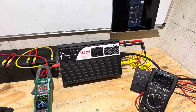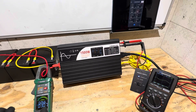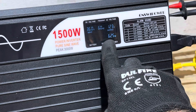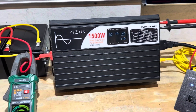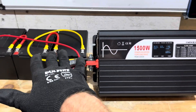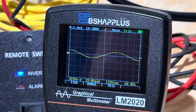The power cord is going out to a 12 volt charger. I'll turn the charger on and watch the current climb on the DC side. We're at about 3 amps DC as the charger initiates. On the AC side, the draw is 624 to 634 watts — that's about what this little 12 volt charger pulls. Battery voltage is at 36 volts and we're pulling 18 amps out of the batteries, which have a 20 amp BMS. The sine wave output shows a little bit of noise from the power factor on the charger — not bad.